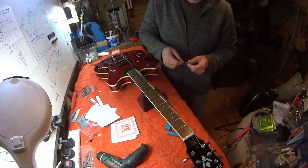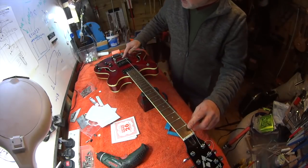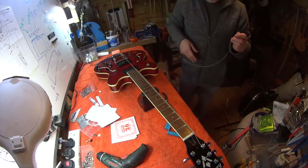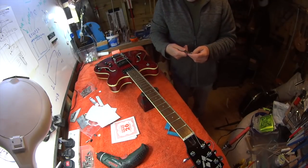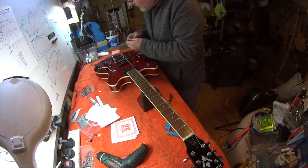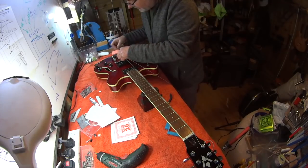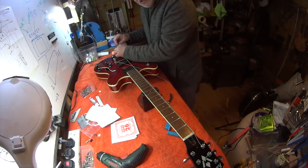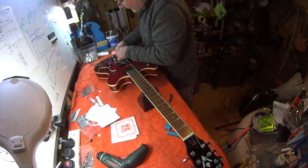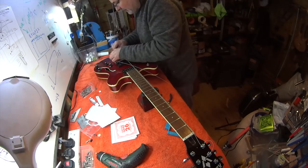Now I'm looking at that, and actually what it's telling me is, have I? I may, no, when I tighten it up, I may have just got it right. A challenge with putting the adjustable nut in with its Milliput base is that you have to gauge its ideal starting point as you're putting it in, and you're shaving down the base.